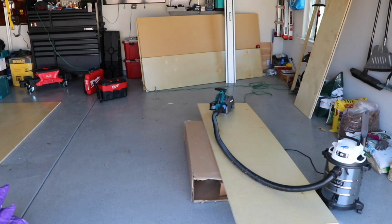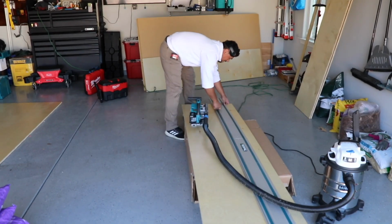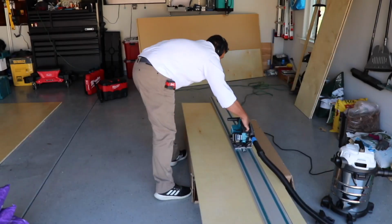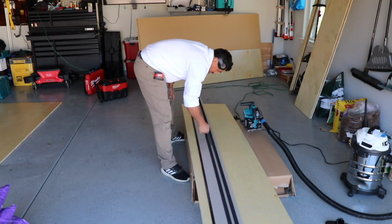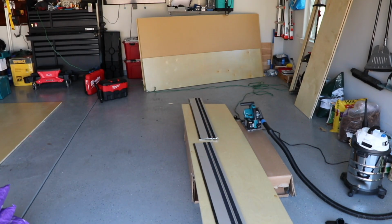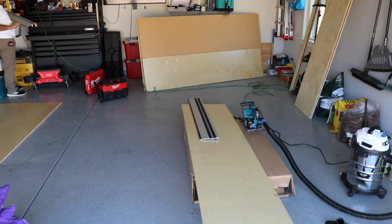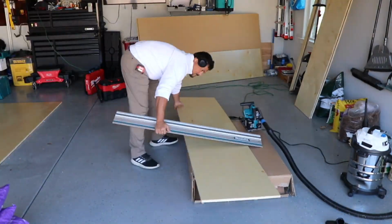That's my son, and just getting everything to the depth, or yeah, if you want to look at it width, but it's really the depth of the cabinet, and getting all those set. Checking the cuts, check them against each other. And that's kind of like how I like to break my material down. Get everything to the depth first, and then I will start to cut the other material from that.